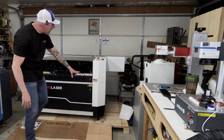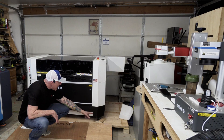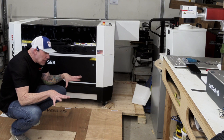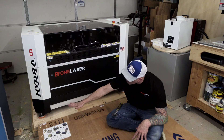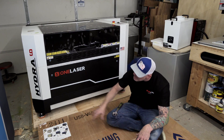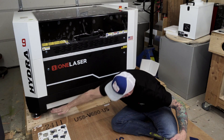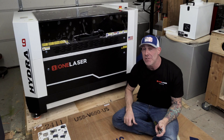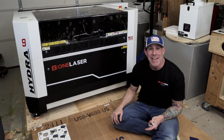The Hydra 9 comes with four casters on the bottom and four leveling feet. Right now it's sitting on the pallet with spare pieces of wood nailed into the pallet on those leveling legs to keep it secure. In order to wheel this off the pallet we're going to remove those with the hammer. We also want to raise those leveling feet all the way up with a crescent wrench so they don't catch on anything going down the ramp. I've got all four casters pointed in the right direction — make sure all caster locks are disengaged before you try to move this off the pallet.